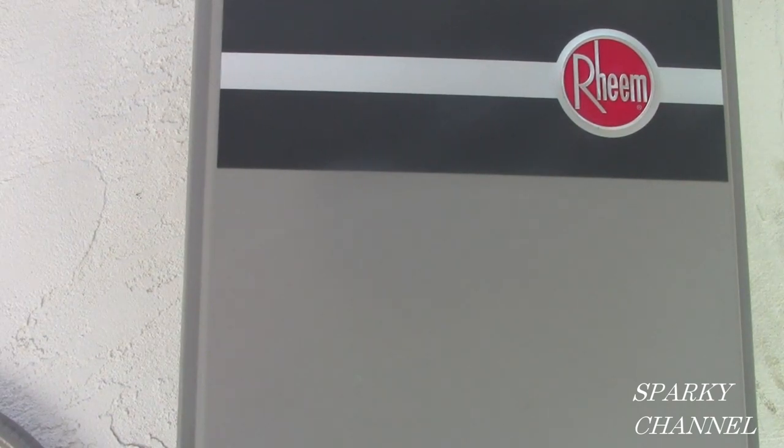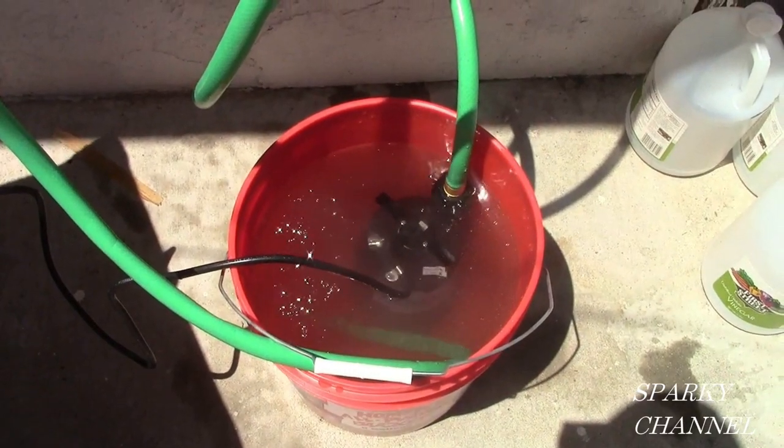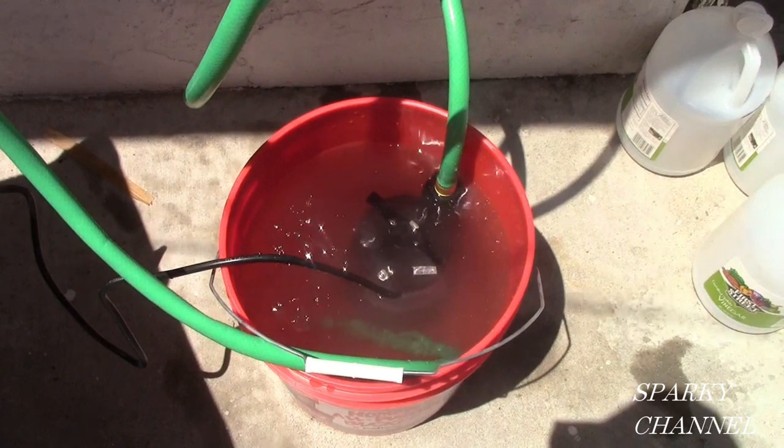If this procedure is done incorrectly, then the bypass valve will be left on, and what will happen is that the vinegar that you're pumping through the system will bypass your heat exchanger or heat exchangers. You want the vinegar running through your heat exchanger. That's the whole point.